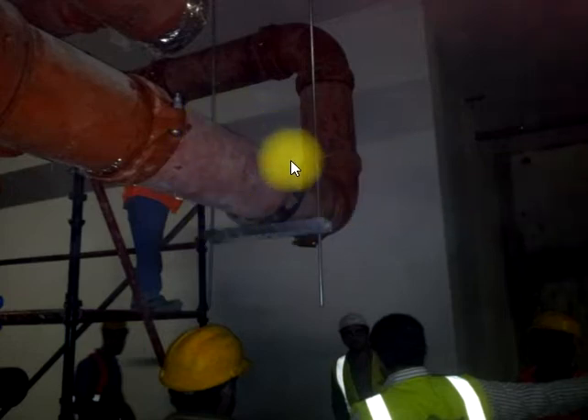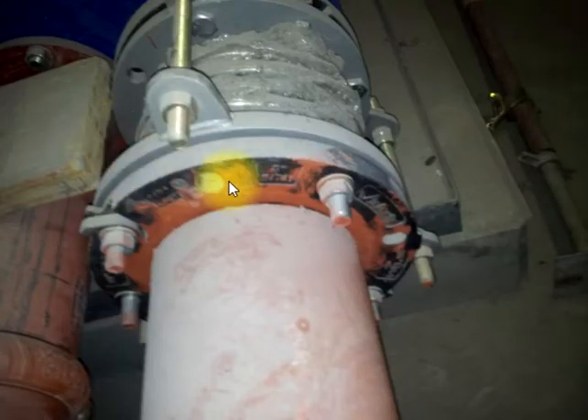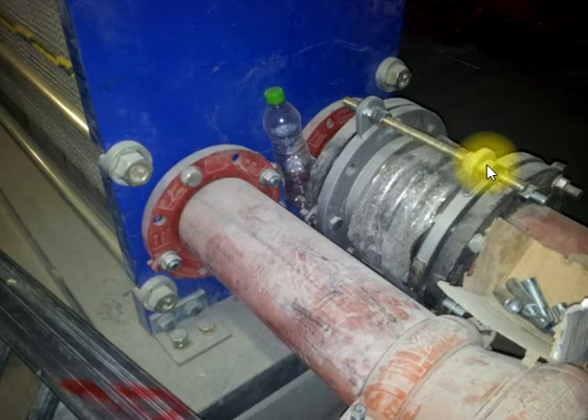Here the rubber is hung but there is no U-bolt — it should have a U-bolt. This piping restoration is not acceptable. There are bolts missing here, missing here, and missing here — you have to take care about the bolts. This is a heat exchanger installation — there is a flexible rod coming here which should be removed. There should be a proper rubber flexible pipe as per specification, because this flexible rod is causing problems. Bolt missing and the flexible heater rod are not acceptable.